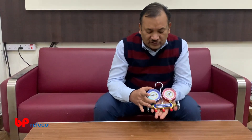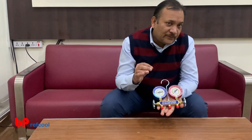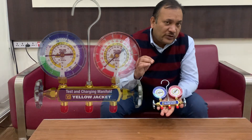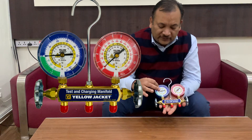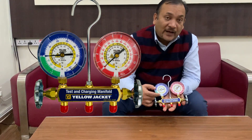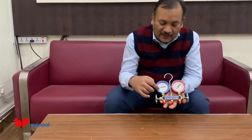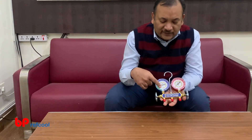What is unique about this manifold is that it comes with 3-inch gauges which are specifically designed for R600A. If you are looking for R600A, most of the time the suction pressure is going to be under vacuum, so for calculating superheat you need to accurately measure the suction pressure. In this gauge you can see one-fourth of the gauge is under vacuum, so you get a very good precise reading. As you move on, it reaches to 4 bar.